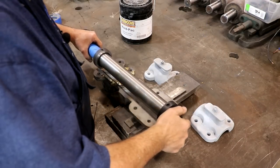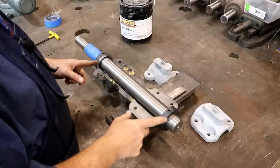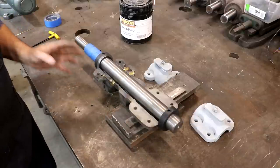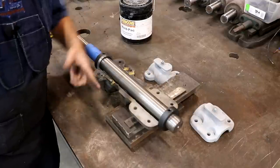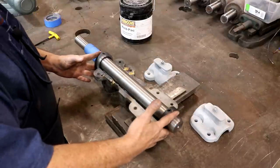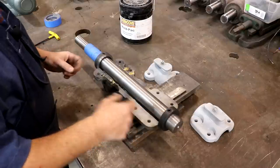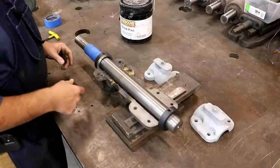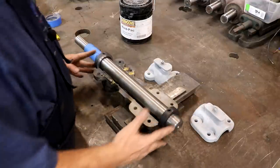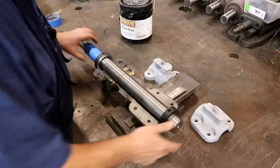I've got my little spacers on here. You can see that I've got them notched out to kind of fit up into this. What this is going to do is position that shaft right in the center of where it needs to be. It's going to sit right in there, and these are going to hold it in place while I pour my bearings. I've got complete clearance all the way around, room for my Babbitt to move all the way around. Two things: it's positioning the shaft where it needs to be, and it's also serving as a dam. When I pour the Babbitt in here, it's going to want to run out the ends, and I've got something here blocking it.